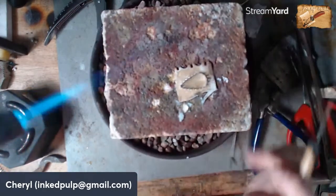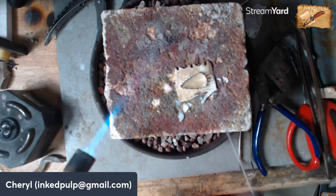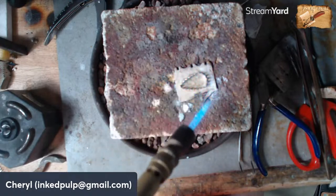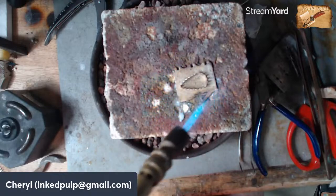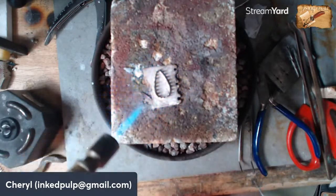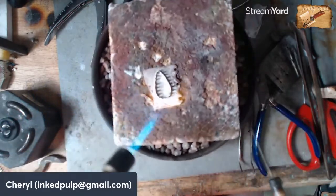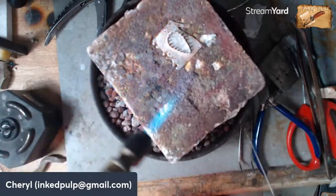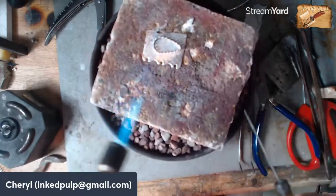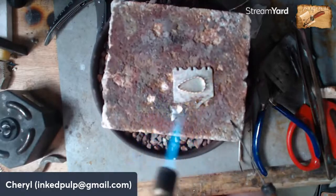Once again I'm going to heat it. The bottom piece is bigger than the bezel — the bezel is very delicate — so I have to be really careful not to hold the heat on it. I'm going to go around the outside and heat that plate. See the flux turning white — it'll be white, then it'll turn where it looks real dirty, then it'll turn clear. Now I'm going to go in the middle a little bit but mostly going around the outside because I don't want to melt those little prongs. There it goes — starting to melt!